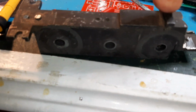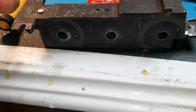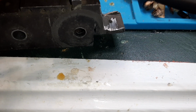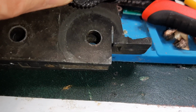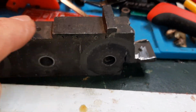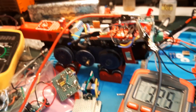But I had an idea, and I did one once, where I grind out a groove right here so that there's that space for the gear, and then I set the gear down using my little stand, and I set the gear right down inside that groove, and it would rub on that worm. It would sit down like that and rub on that worm, and we would have puff and chuff for these engines that never had nothing. Yes, we'll have this system.